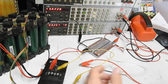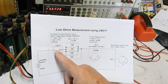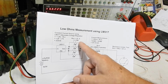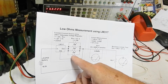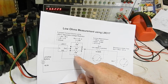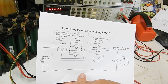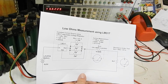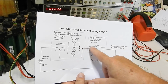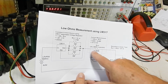And this is what we've got there. There's battery going into the regulator through the 4 resistors, which at 330 milliamps, each one of these resistors is generating about 0.1 of a watt heat, and they're half-watt resistors, so they're okay. They're running at 1/5 of their rating. The adjustment connects to the other side of those resistors, and then that goes through our 20 ohm resistor where we're measuring the voltage across to verify the current.